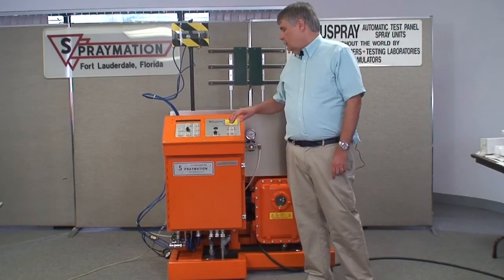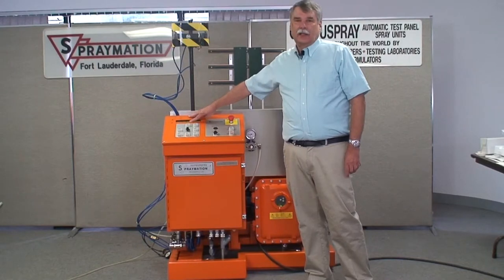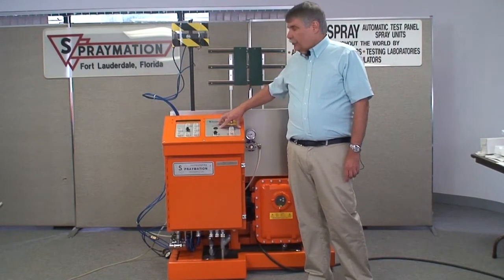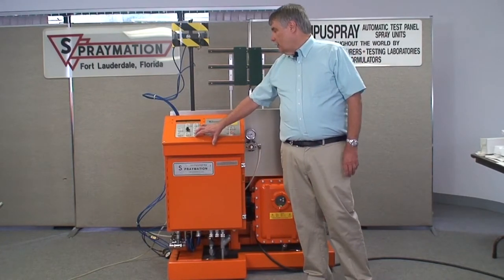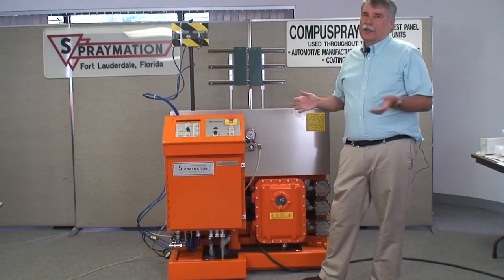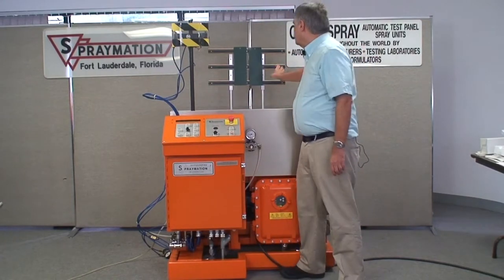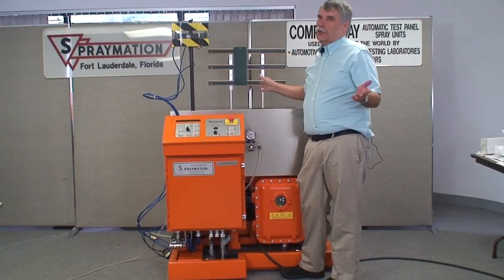This machine has a feature to clean the spray gun at the end of the operation, so you can say yes or no. You should also notice that the cycle active light has stopped blinking because the operation is complete. The cycle has ended and the machine is ready for the next painting process. We push the emergency stop again before we reach across the machine to pull the panels off, so that we're always safe.